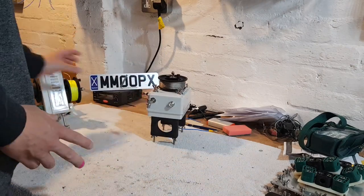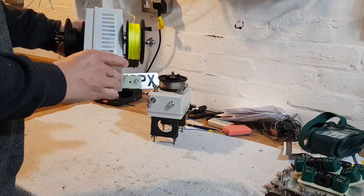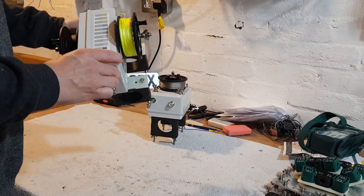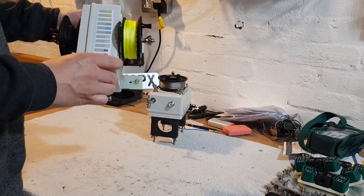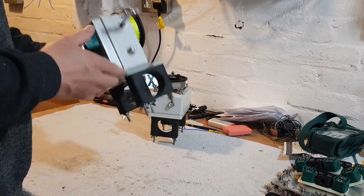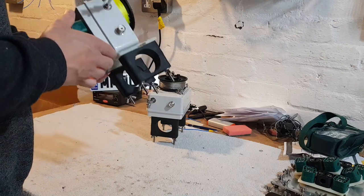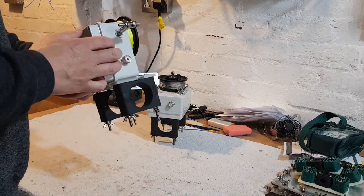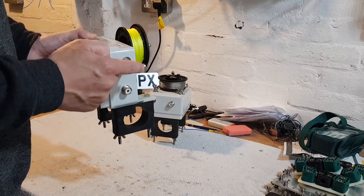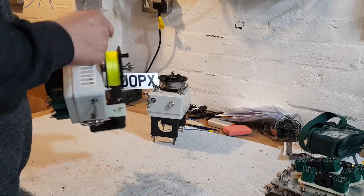So a little bit of a history lesson. This is the AdjustiWave Essential — my favourite antenna. This has been going since probably November or December last year. The AdjustiWave Multi is similarly based on this. It uses the same enclosure, the same SO239 fitting, and the same swing bolt configuration for attaching ground wires, but it only has one reel.